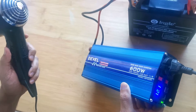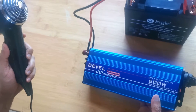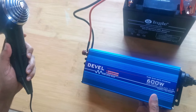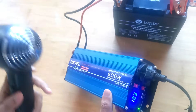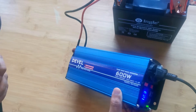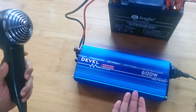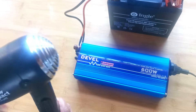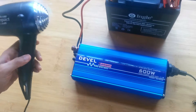Now I'm going for maximum power — 1200 watts — let's see what happens. As predicted, it's able to sustain peak power of 1200 watts for about three seconds, after which it reported a fault and disconnected the power output. This is quite a nice inverter — it's a pure sine wave inverter and it does what it says on the sticker.